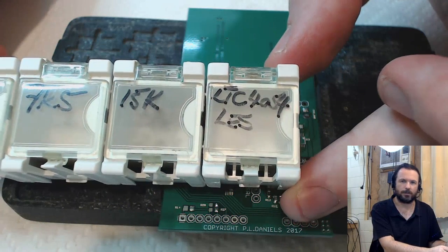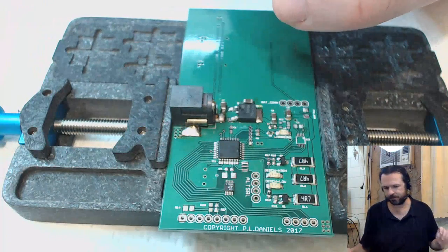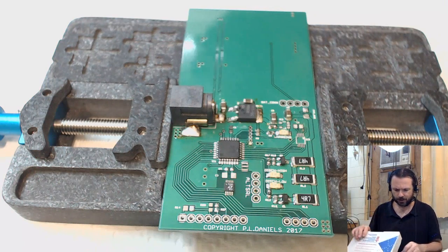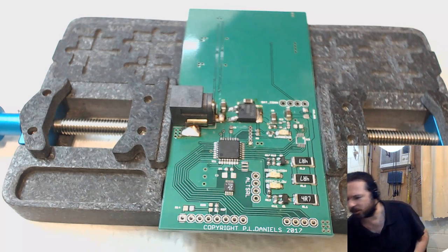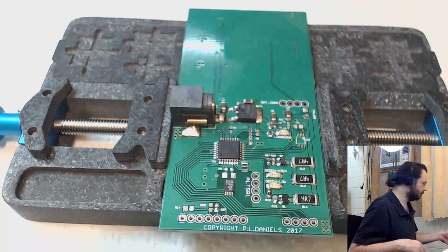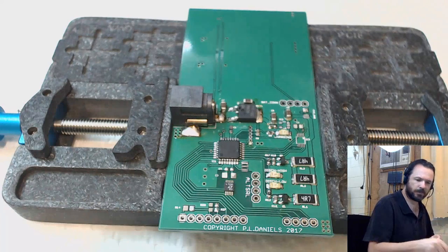Anyway, that was for the Microchip one, and I found that I actually also have my Linear Technology one, the 4054, which is a better controller charge chip. It can handle, I think, up to 800 milliamp, but I'm only going to run this at about 600 milliamp, so it does mean the battery will take a little bit longer to charge, but realistically, you can't do 800 on these boards,